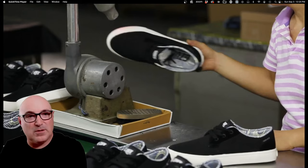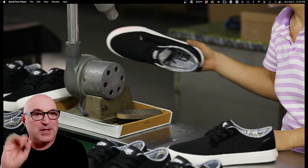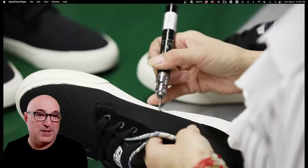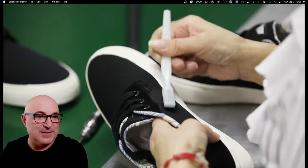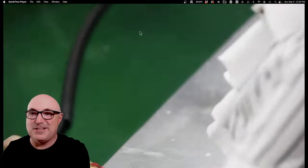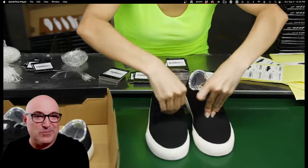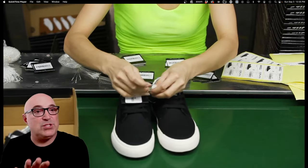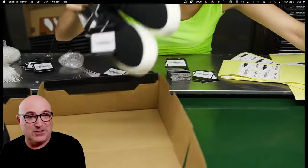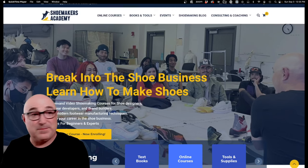That industrial blow dryer melts off any loose threads. They're just going by looking for loose threads, though those should theoretically be caught during inspection. There's a little cleanup for any pencil or pen marks. The conveyor belts look pretty clean, and for a shoe with a nice white sidewall, it's got to be clean. The worker checks the size, makes sure she's got a pair, puts the tags on, checks the box-end label and both shoe sizes, and the inspector puts the tape on. That's the process.